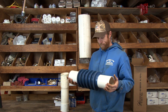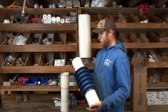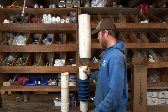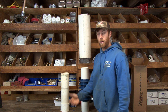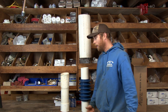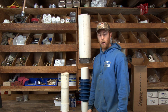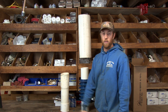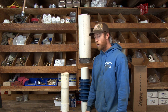So there's the gist — not a whole lot to it. This is made by Western Rubber Products. Not really that much money. This packer might be 150 or 200 bucks, and then whatever pipe you need to get it from here all the way up out of the hole — that's typically going to be your cost. And then if you have to run screen pipe, that's typically all you're going to have in it. So if you're having sediment issues and you've got a well that's older, it's something you can have your well contractor come out and take a look at. Sometimes depending on your situation it can be just as easy to go out and drill another well in the ground, but there are options out there for you. It just depends on what's best for you, the customer.